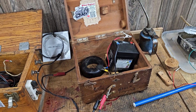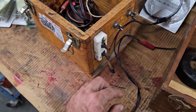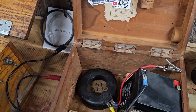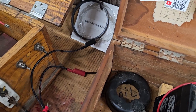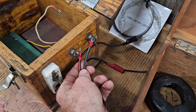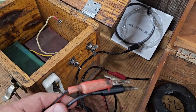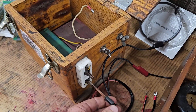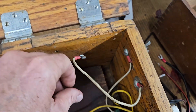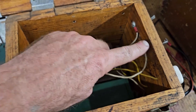The second design is one I actually bought at an auction, and it works just as well. This one has a nice switch on it right here. The way these wires work — you hook them up to the thumb nuts like that. The way this design works is you can connect the alligator clips to your igniter, but until you throw the switch it's not going to be hot. The wiring is kind of the same way — the hot comes into the coil and then goes out to here.